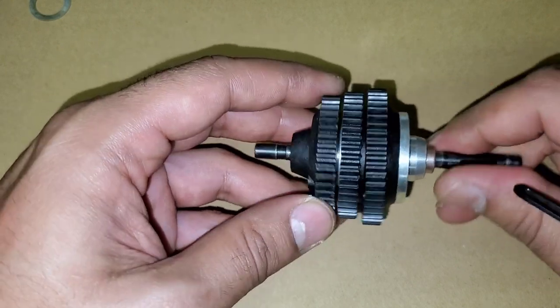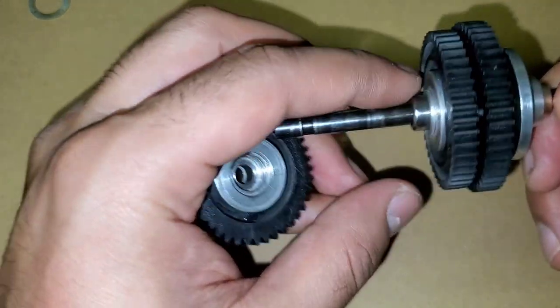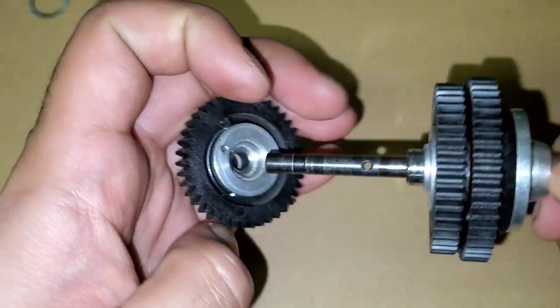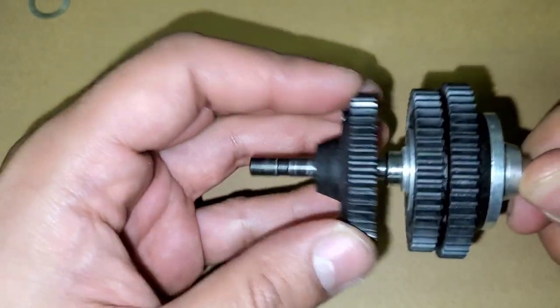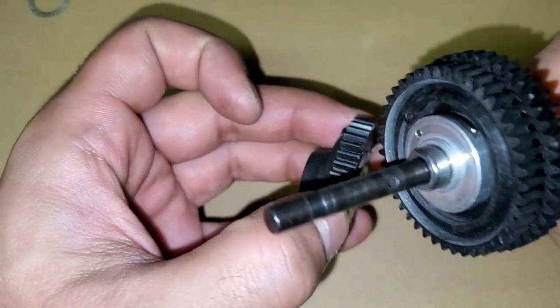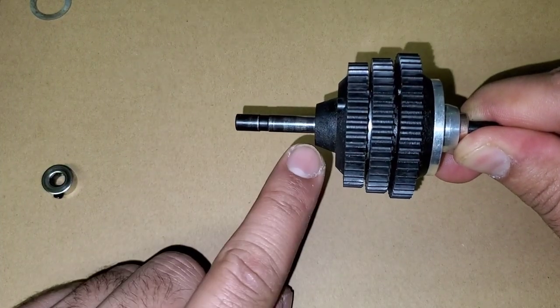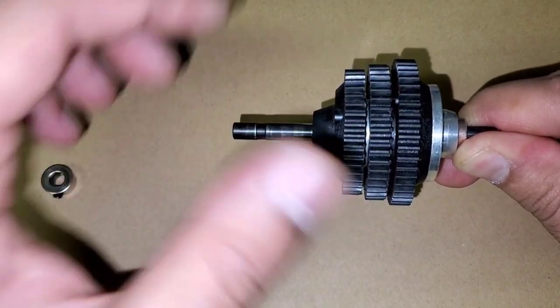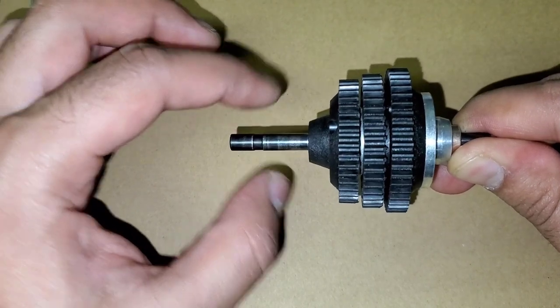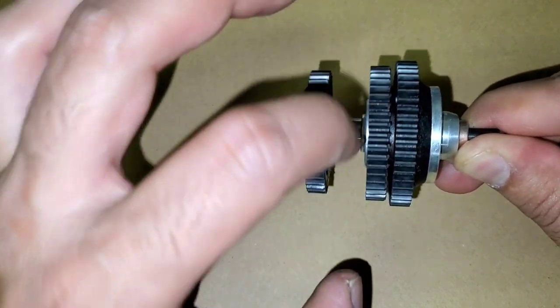As you can see, this is the three-speed cam, and it shouldn't be sliding off the shaft because there should be that pin holding it in place. There's a small hole in the shaft that the pin is supposed to go through, and there's a pin in that cam too. When you're trying to adjust the transmission's two-to-three shift from outside, you would undo that collar, push the shaft, and slide this over — that should remain in place so you can adjust the grub screw on it.